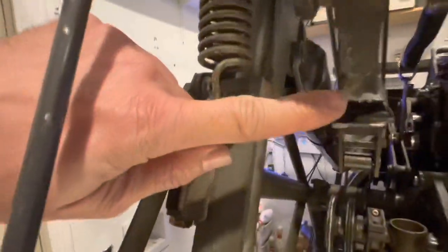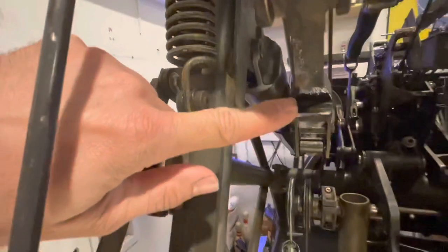Here you can see how the scissor cable on the inside works — right here where it releases the scissors. There's the deck holding hook. You'll see it hold on second ball to keep the deck from going down. Right now the deck would be going down but the hook is holding it. There's the rake sweep hook right here that it catches to run the rake back. There's the 4-to-1.